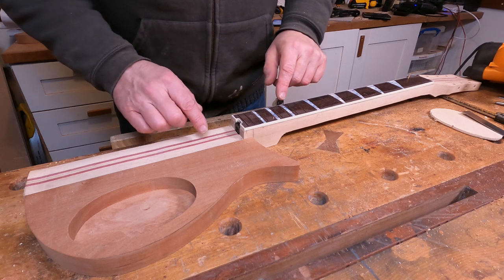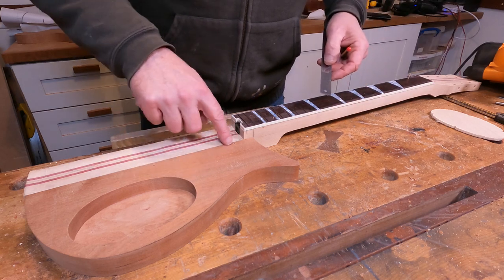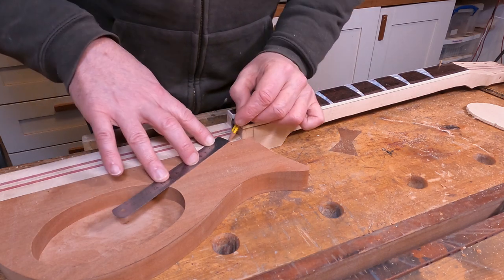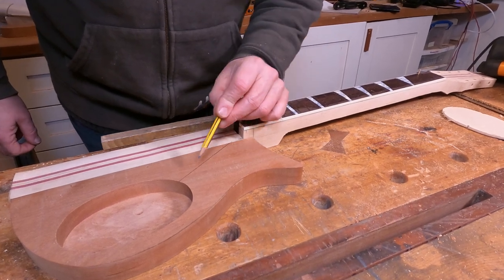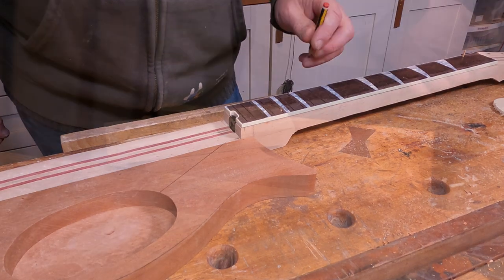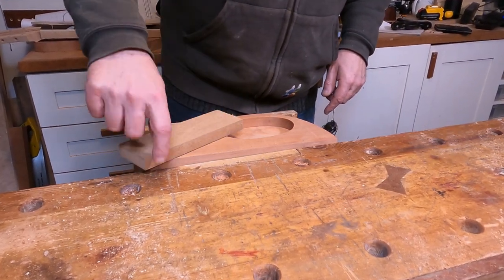Having done this, it's not as difficult as I thought, because we've actually got a mark there already that indicates where our front pickup is going to be — that little screw hole we put on the center line of the pickup. I don't want to route that out because I need it, but I can run my little channel quite close to it and that will still preserve that screw hole. Once we start to route out for the pickup, that material is going to get removed anyway, so we should have access running through there. Routing this in is going to be very straightforward — I've just got a straight piece of MDF superglued and masking-taped on, and we'll take a couple of passes to drop that down about six mil.